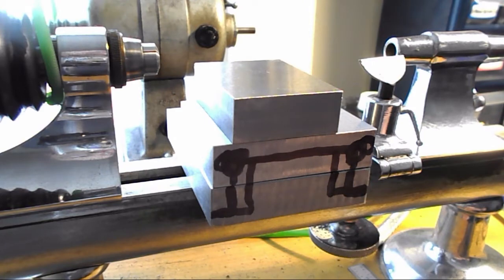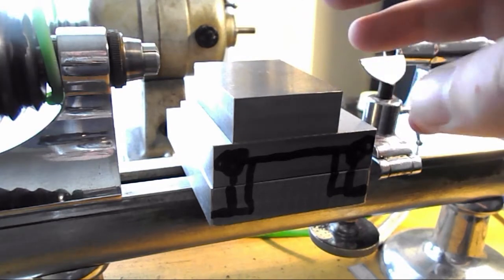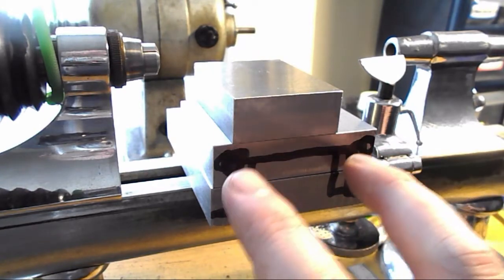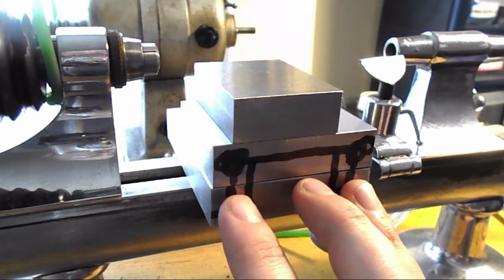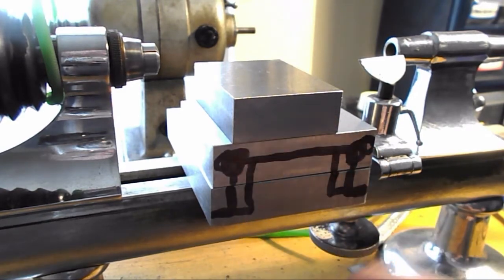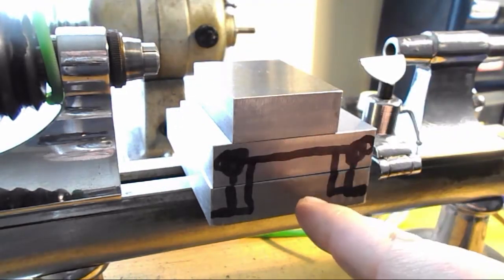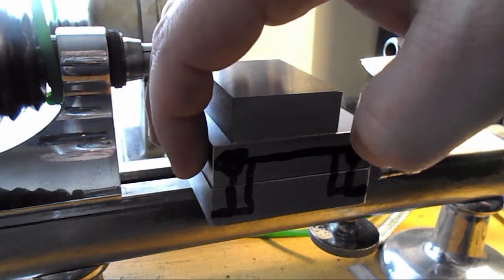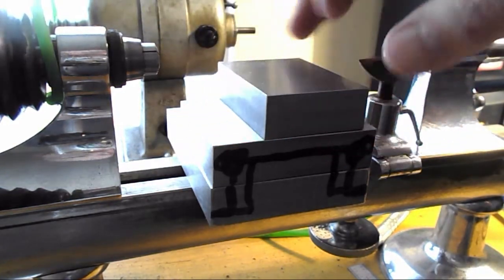Then I'm going to start milling away this section. I want to make sure there's a very good sliding fit — I want to have a little bit of play, a few thousandths on either side would be fine, because really the shafting is going to be what keeps it in place. On this side there's going to be a piece mounted — I'm going to drill and tap some holes in here — a piece mounted here to hold the shaft in place, and a piece mounted in the back to hold the shaft in place, and obviously the screw to move it forward and backward. And then the same thing here, with some guard mounted here to hold the shafting, and same thing on this side.